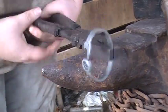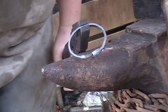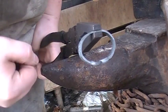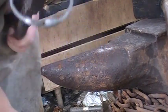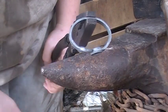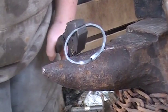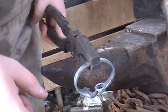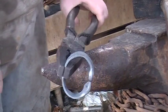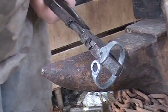That's what we're looking for — now we can get started on the rest of it. The ends will be the hardest part to bend because they have the thickest portion and it wants to bend where it's a little thinner. We have her rounded up all the way with a little kick to it. Next I'm going to open her up a bit so that way it'll fit around the wrist. This would probably fit on someone's wrist, but this is going to be mine — it's the first one I'm doing of this — so I'm going to take another wrench and use it like little scrolling forks to open that up to the right size.